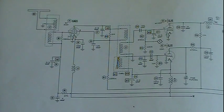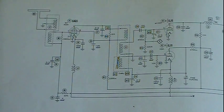Plus, also, I can have any number of bands and frequencies I want, because that's all done up in the front end. I don't have to worry. The IF can care less about that. All it cares about is it gets that one IF frequency. So that amplifier still is seeing the IF frequency, and that's all it's got to amplify. It can care less whether you're on the broadcast band or you're on a shortwave band.